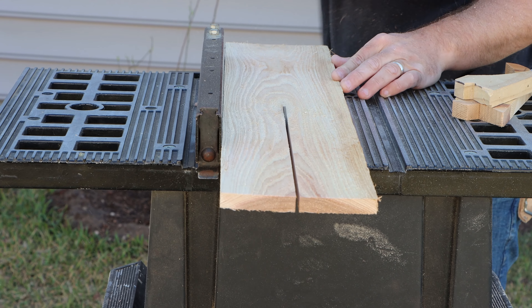After your corner pieces are done, you're going to lay those down and place the long boards in between them, and you're going to attach the boards to the corner support to make your wall. Drill and screw the boards together. We drilled and screwed the holes from the inside to avoid seeing them from the exterior of the planter bed. We drilled the pilot holes at a slight angle to ensure the screws did not go through the other side of the board.